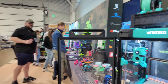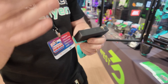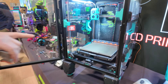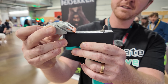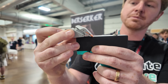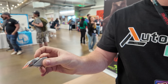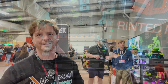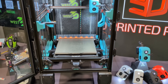What's going on with the scrapers mechanically? There are seven of them across the back bar, and the blade is not touching the bed when it's in the printing orientation — there's a little gap. As the module approaches the bed, it brings the blade to the bed and then tensions the blade to the bed. So two stages: translating the blade and then pre-tensioning the blade. That is really clever. Loving how much of this is just kinematic motion — no extra servos or wiring. Your four motors are moving stuff and the way they move activates different functions and orientations.